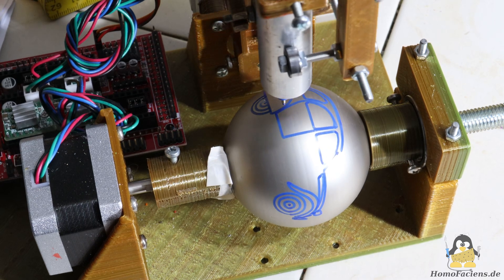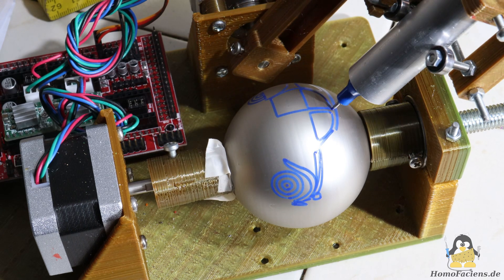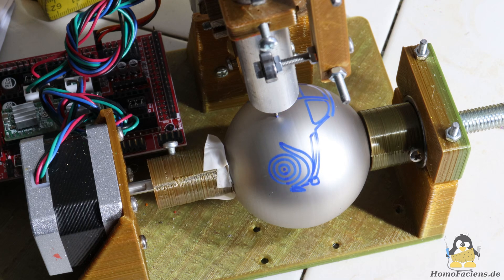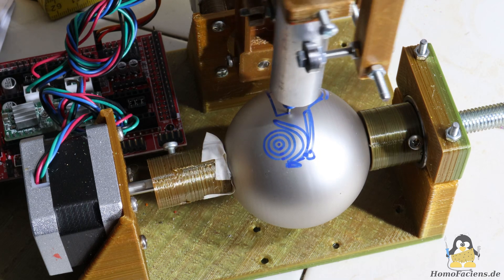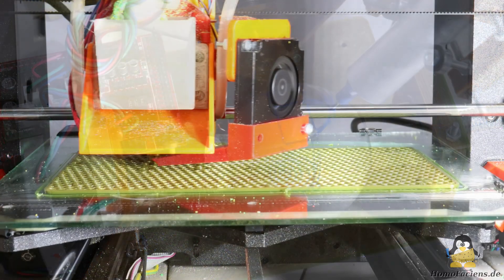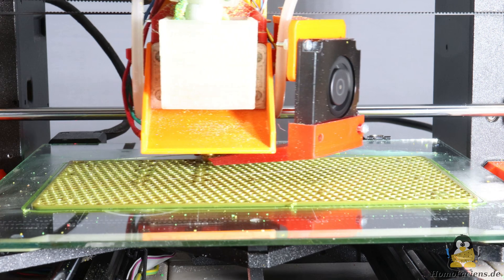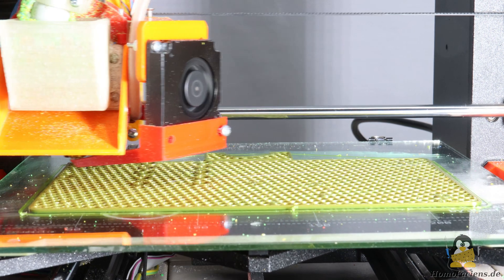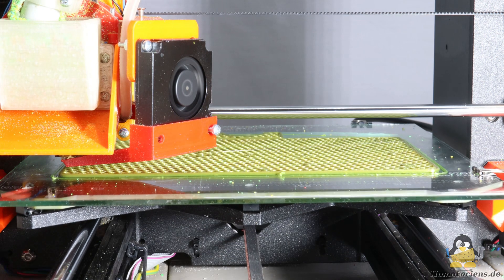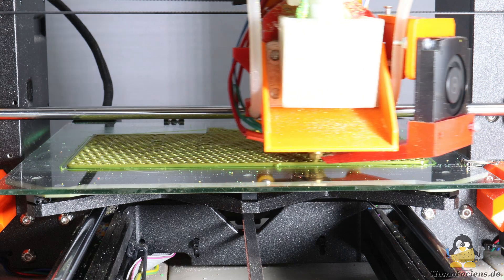This ping pong plotter was created as a quick project for a weekend. Two stepper motors, a small servo, an Arduino and a RAMPS board are needed to decorate spherical objects. The parts for the mechanics were printed from recycled PLA using a direct granule extruder. Printing nothing but benches is boring and not really relevant in practice, so the ping pong plotter was created as an extended printing test.